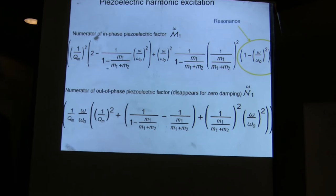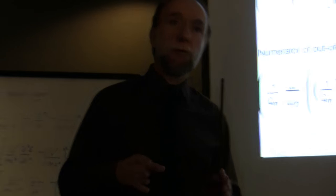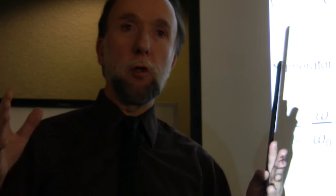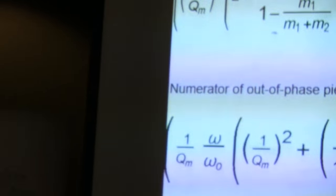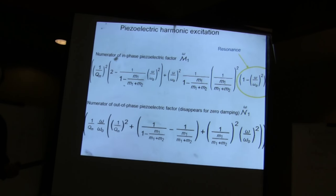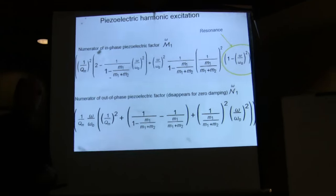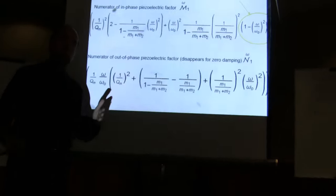Yes? How do you determine how much pressure you need to put on a bolt? Excellent. It should not be on a torque basis. It should be based on the stress. That's what matters. So you should do an engineering analysis, either a closed form solution, which I think is a very simple geometry, one can do that, or a finite element analysis, which is what most engineers nowadays take the easy way out with, and then they don't want to think about it. They just run the drawing through the finite element analysis, boom, I get the stress. But you should always arrive at the same stress. And theoretically, it should be done taking into account fatigue. That is a very involved subject. Most people don't know about it. You could take an empirical point of view, at least do a few experiments. Would this work?